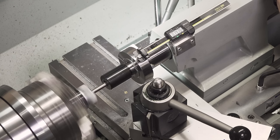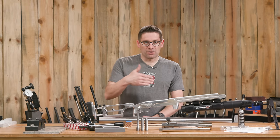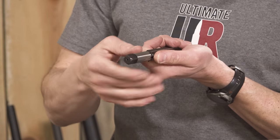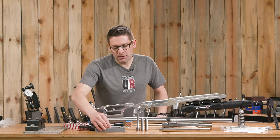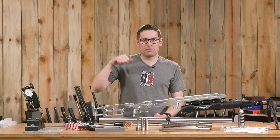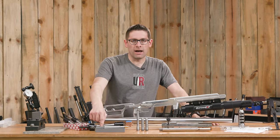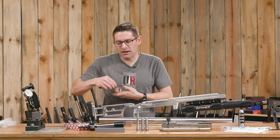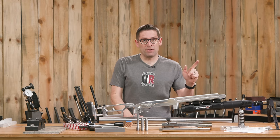I took a couple of passes. I didn't have pin gauges at this size, so I had to take approximate measurements with digital calipers — not really the best way to go. I took a little cut at a time using the back side of the reamer. If you look at the flats, there's a very small ground surface there that is the same diameter as the shank body itself. I worked my way up: two thousandths, one thousandth, a half of a thousandth, measuring each time. I was turning at a fairly fast spindle speed, cranking in and then cranking slow back out. I finally got it to the point where I had to push really hard to get the edges to engage. I knew I was getting really close to my final diameter, and everything was cut perfectly straight, true, and perfectly coaxial with respect to the spindle.